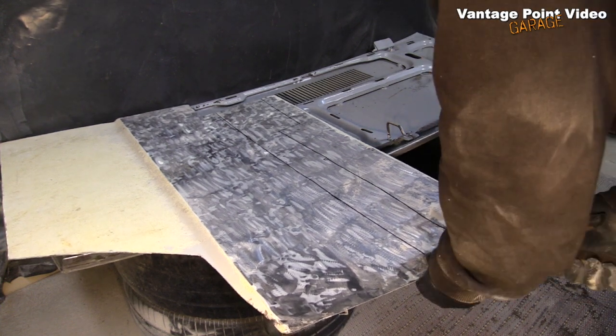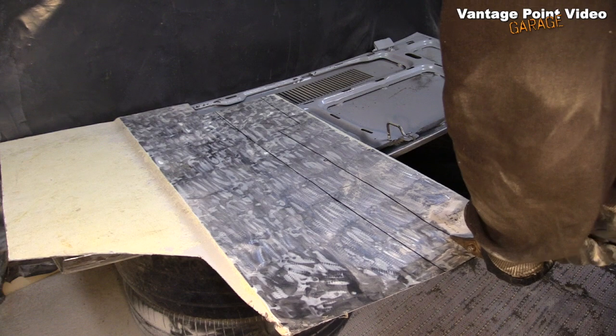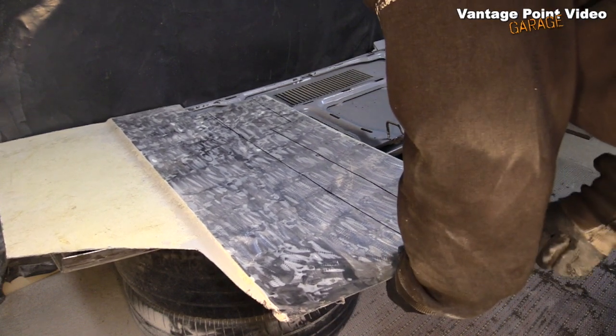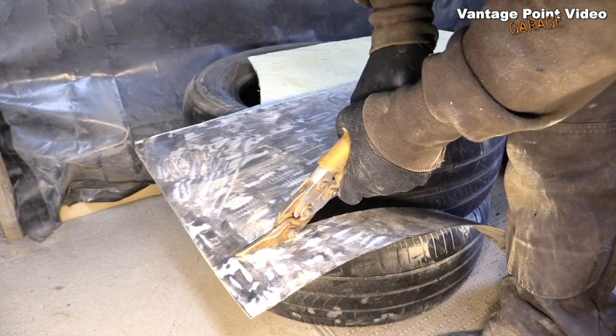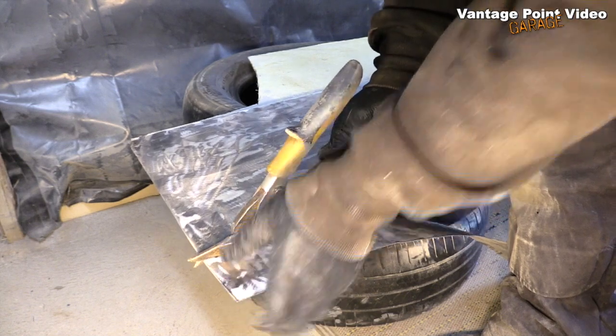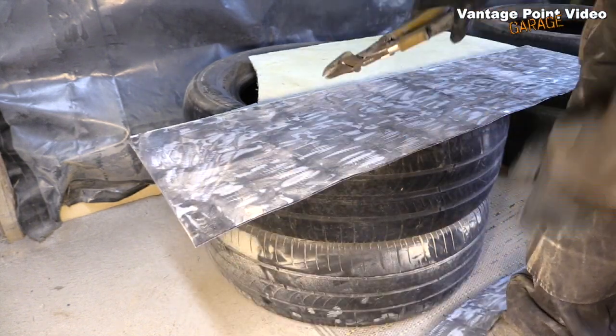Cut it out. Some people lose patience seeing me using the snips for these long cuts instead of the cutting disc on the grinder, but I just find that you end up much closer to your line and the panels fit up easier when you go to fitting them.